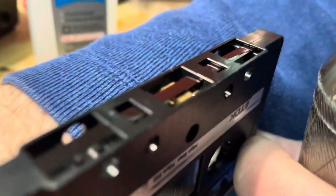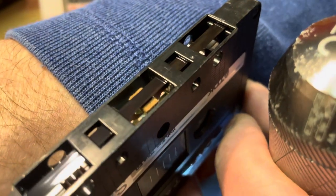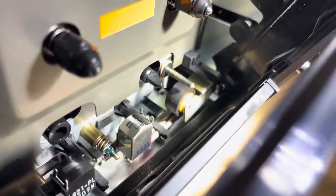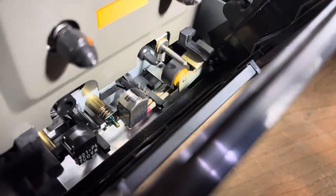Let's try it again — hold it in place there. If you have buildup on your capstan, it will cause your tape to get grooved. Here's an example of a tape that's grooved — this is a very old tape and you can see there are actually grooves in it from dirt that was on capstans over time. This is probably about as good as we can get; it doesn't have to be perfect. The rubber absorbed everything in, so I'll use my finger and go around the rubber capstan roller with rubbing alcohol. Rubbing alcohol is not bad for rubber parts. At this point it's pretty much dry, so we'll be able to use a tape. For the first tape, let's put in one we don't care about just in case there's a little residue — put a crap tape in first.